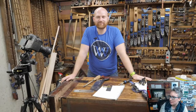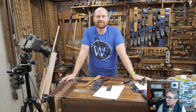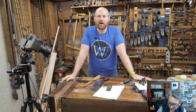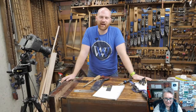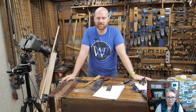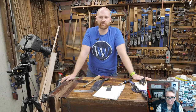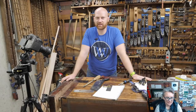Gracias. Let's see. Alan Isaac: What would you recommend as a good first project for using a draw knife? The first project is just get a stick and make it really small. Go to town on it and have fun. Because that's one of the problems with a draw knife right off the bat, not taking off too much, because it is a lot of fun. And a good sharp draw knife that's set up well will chomp through wood incredibly fast. And getting something two-dimensional is actually a bit of a challenge because you often end up taking it a lot smaller than it should be.